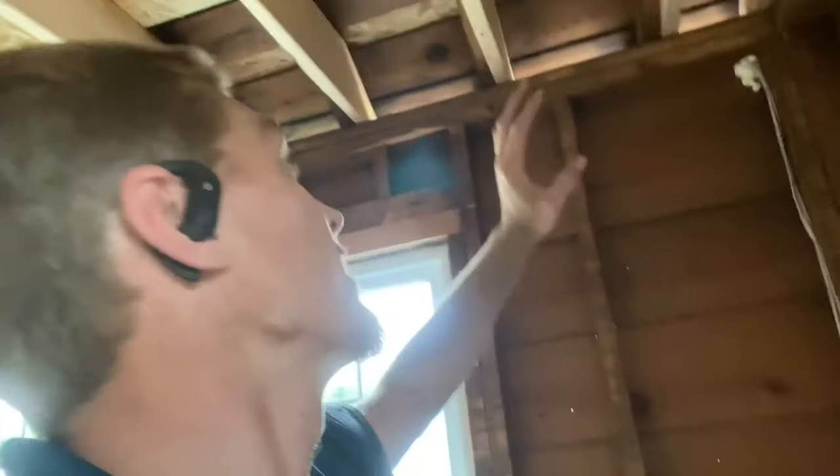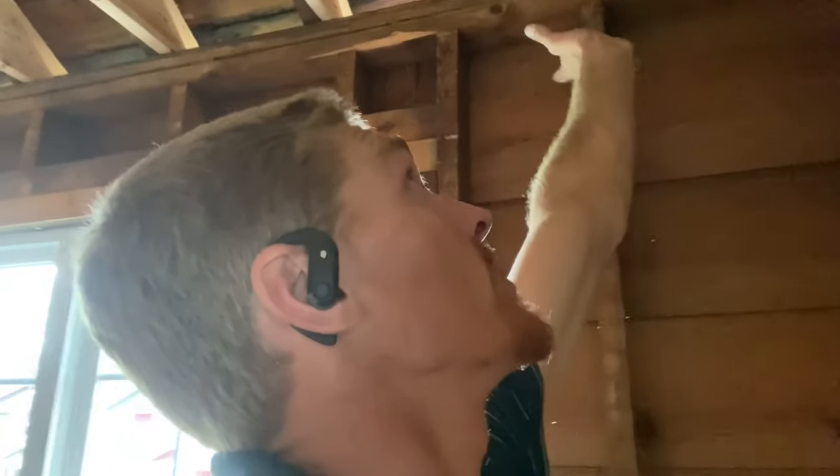Basically what I have in mind right now, just before drywall, is right up in here. This is going to be part of the attic, but I've got to get that done before we get drywall because this won't be accessible. So I'm going to close up the gap that's up in there with a little piece of foam board, and then spray foam up in here to where it's accessible from where the rest can be got from the attic later.